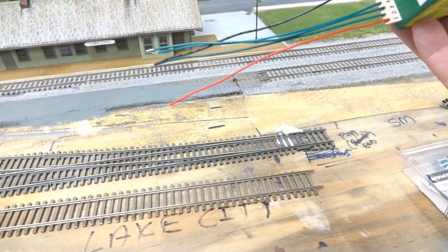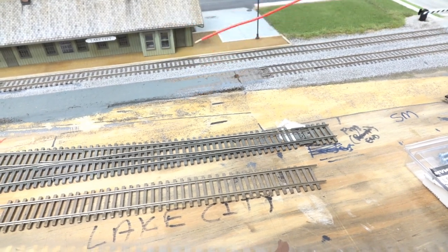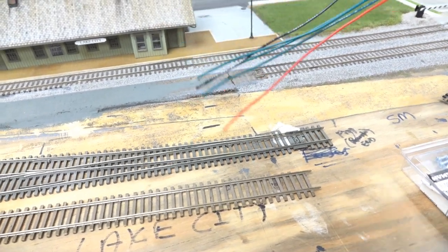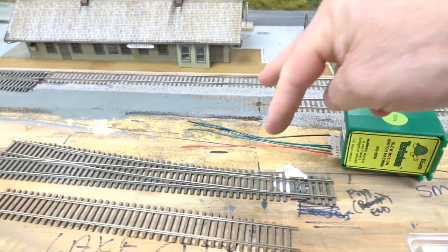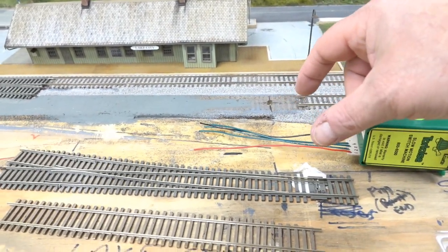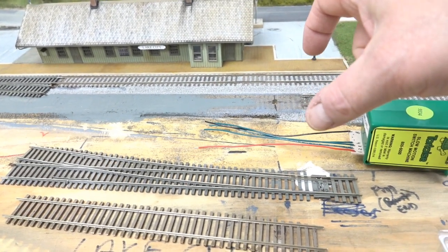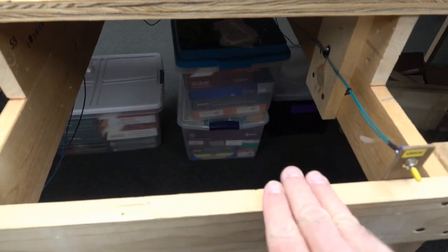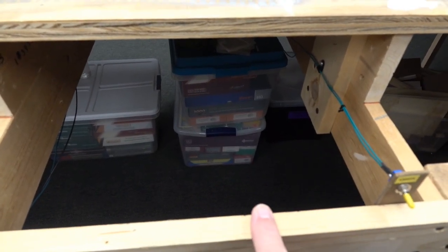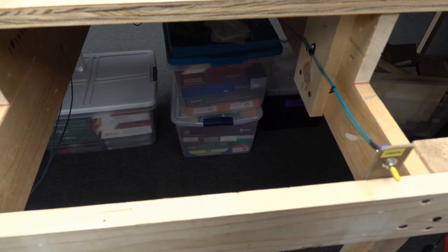Either it's open or grounded. If it's grounded, it means it's reverse. If it's open, it's normal. The signal system knows and all that kind of fun stuff. So this I'll put here, wire it down, and then on this terminal board, which will be a 5-point, I'll bring the 1 and 8 from the other over together, and then 12 volts will come in. I'll bring it out to here. I'll have a resistor out here to drop it down to probably 9, and then I'll just do it by hand.